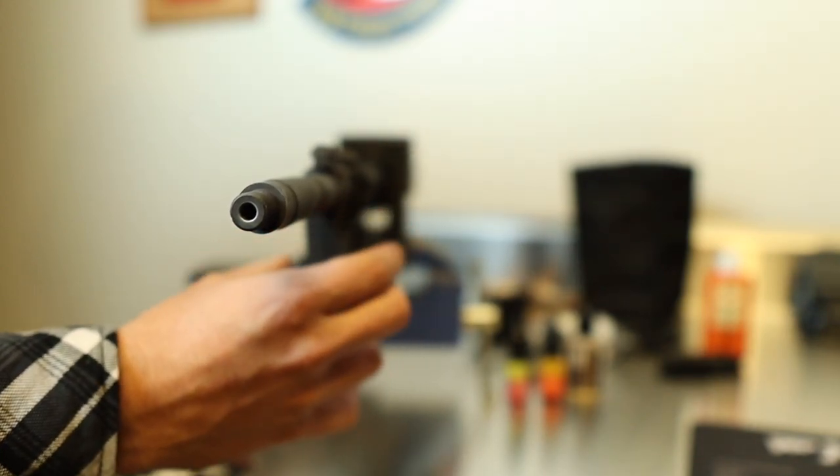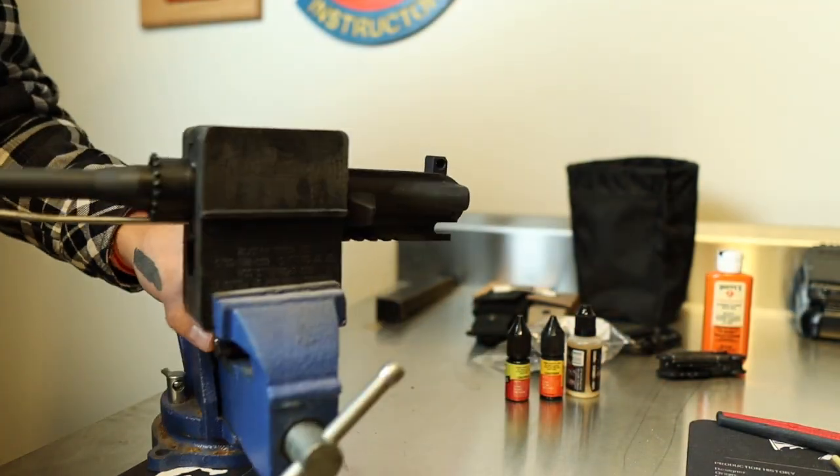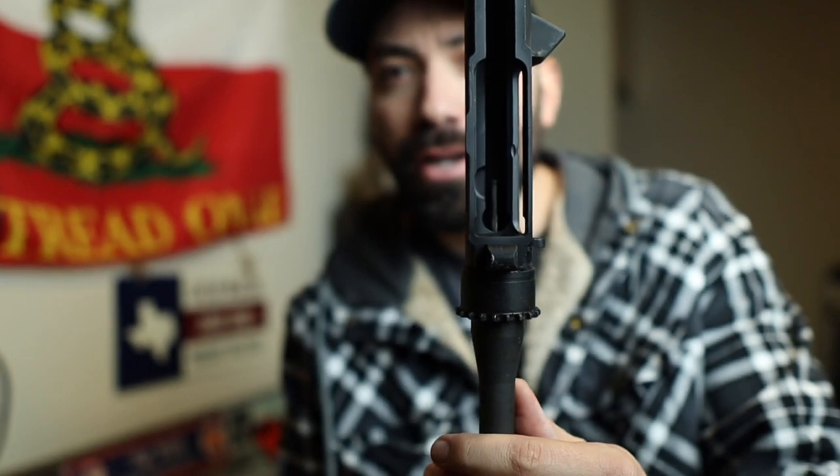All you do is drag your fingers over that hole and make sure there aren't any pieces of metal sticking out, no burrs or anything like that. Just like that, your gas tube is now installed on your AR-15. Now we have the gas tube installed into our upper receiver. One little piece of advice: you can actually check your work by looking inside your upper receiver and making sure the gas tube going inside is straight up and down. If it is crooked, that is not correct — it needs to be completely perfectly straight. That gas tube right there is literally as good as you can get it, so my job was well done.